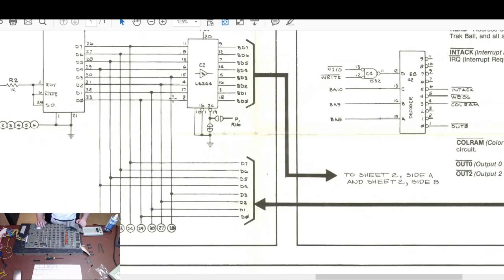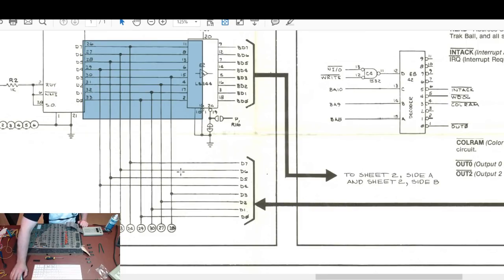Well, we've got no option then but to take some chips out of the board and see what happens. It might be underneath the chip, it could easily be. There's no signs of repairing this part of the circuit. Like I say, it's only complaining about the connection between here and here, or anything on this path here, the data bus path. So I suppose that's going to be job one, is take these three chips out. One of them's obviously failing under load, so which one's it going to be?